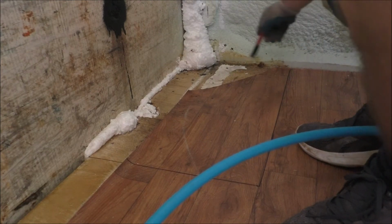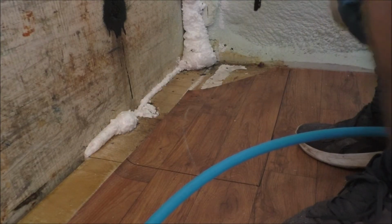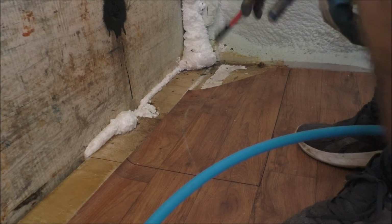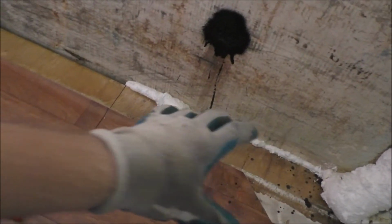But I gotta see underneath where this blacky moldy is, and get in and just look underneath the floor, rip out any mold, bleach, clean, replace lumber with polyurethane coated lumber, and then go from there. And like I said, the plan is to not insulate this wall. So what I'm doing is gonna get the shower as close into this wall as possible.